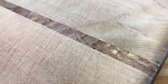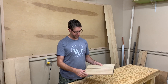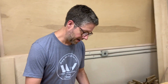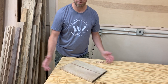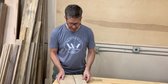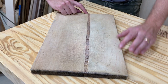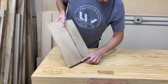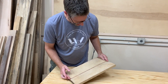There are lots of knife scrapes. When they rinse it, they set it down and it's got some water staining here on the edges, so it's just time for a refresh. I figured I'd take you along and show you what I do to restore this board. It's still very, very flat — this wood is very stable despite them using it every day for the last four years. There's a little bit of delamination happening on that one glue joint right there and this one right here. I can only explain that by it sitting wet for a while after use, so I'm probably just going to try to clean that up by shortening this board just a touch.